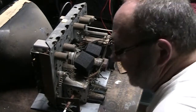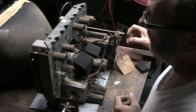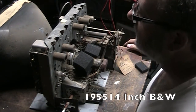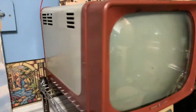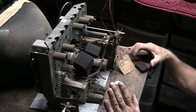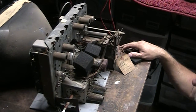We're working on a General Electric television — a 12-inch rectangle tube, 1955-56 chassis, metal case. We just got the TV out of the metal case. We have a raster but no tuner, no intelligence at all. We do have a little bit of scratchy audio, so the audio circuit is working.